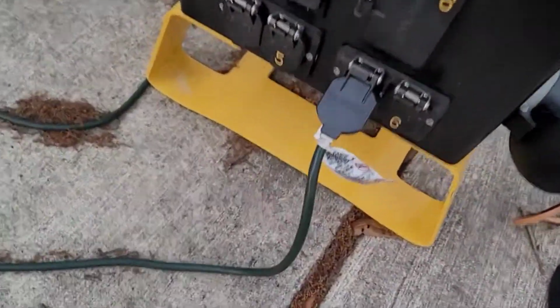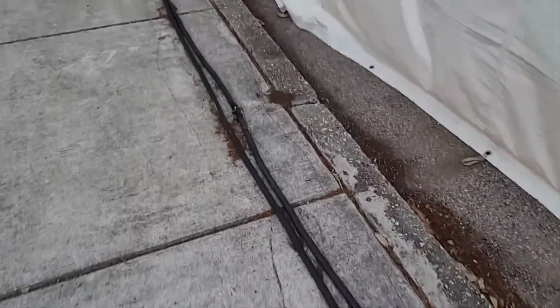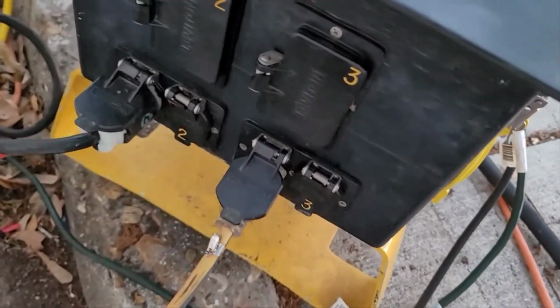We have convenience power. This is the kind of cord you don't want to run. That's a 16-3 wire. And then there's a couple more cords. Then it passes through. I put it into a Y. So as long as we're not using a total amperage of 50 amps, then you can add more stuff. So we've got these 3 power distribution boxes, and it powers the lights and all the hair and makeup equipment inside this trailer. So there's a couple of outlets there, a couple more there, and each one of these sets that are numbered are 20 amps. They're breakered at 20 amps.